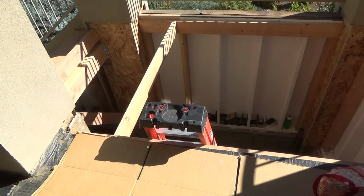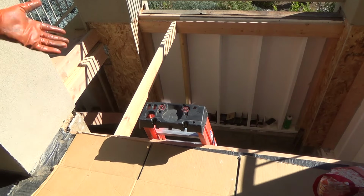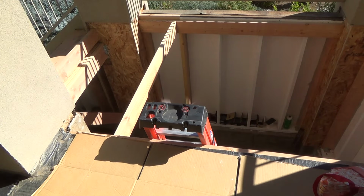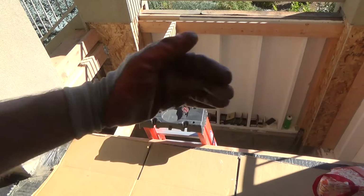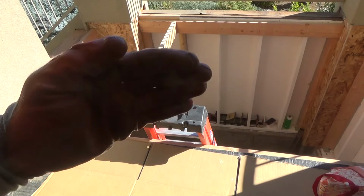And if you've got a large room or something and you want to figure something out, then you just times that by 2. You can go 6-8-10. You know, if your room's bigger. If it's really super big, I've done it for big, huge commercial buildings before, laying out all the walls and figuring out where the T-bar is. Lots of times if there's a T-bar ceiling, I'll plumb down, because usually if I build a T-bar ceiling myself, I make sure that those strings are exactly square.